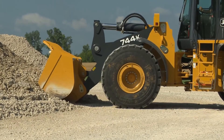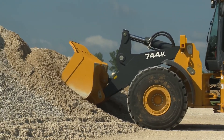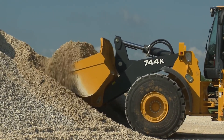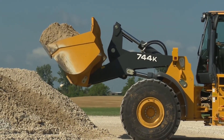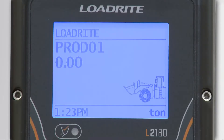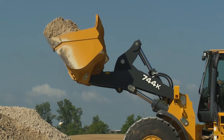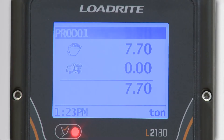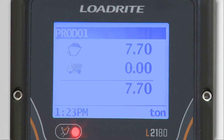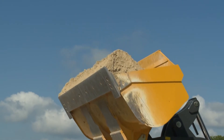When lifting the boom to check the weight of the material or to zero the scale when the bucket is empty, always roll the bucket all the way back against the stops. Lift the bucket smoothly with a constant engine speed. As you go through the trigger point, the scale will display 'weighing' to show that it's going through the trigger point. Do not stop lifting. Continue to lift smoothly until an actual weight is shown. This type of weighing is called dynamic weighing because there's no need to stop moving the boom to calculate a weight. This means the loader can weigh material without interrupting the normal loading routine.